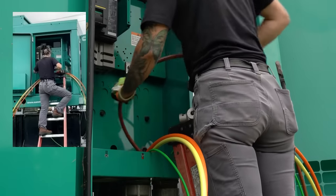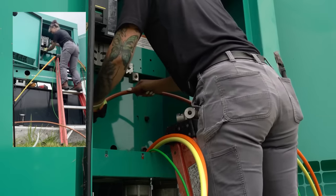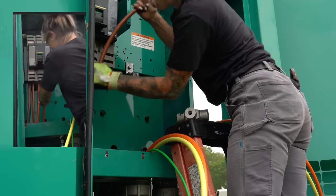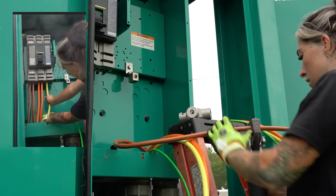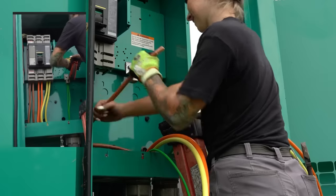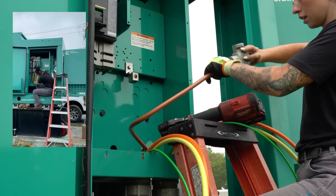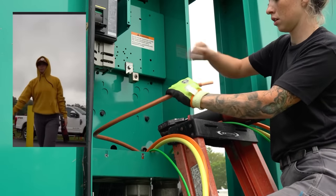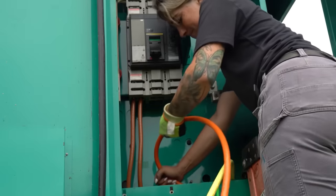These are 4/0 wires — they're not too hard to bend but they're definitely not easy in a confined space. Majority of the day was pushing these wires in and terminating, and it did start to rain on me. The tool you see under my stomach is the Klein Tools stripper set I use for anything above 2 AWG — it really helps and I'll link it below. Those are also my Milwaukee electric cutters — I'll link those in the description too. All this stuff makes my job ten times easier. These wires, like I said, are kind of a pain but once you land them they're not bad.